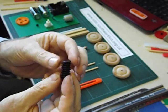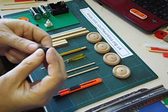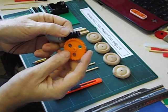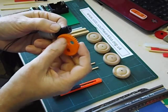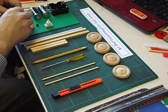It's called a worm gear. This is a worm gear — it's like a spiral. This is fitted to the motor and it meshes with a spur gear like that. And just with that one pair of gears it will slow the speed down dramatically and turn that driven axle with much more force. So here's how to make a gear driven electric car.